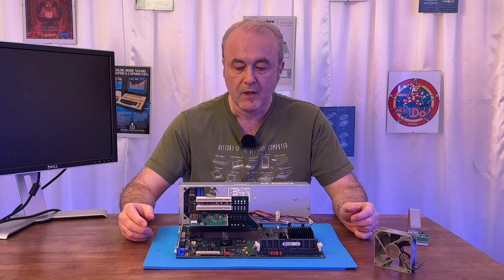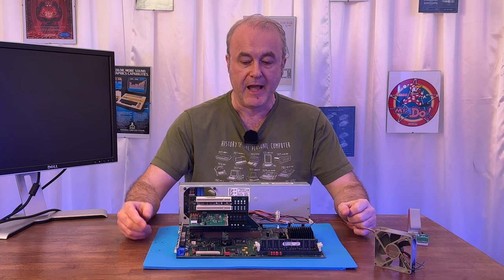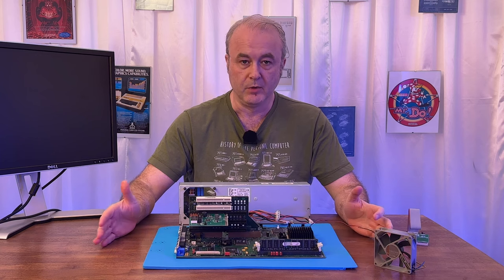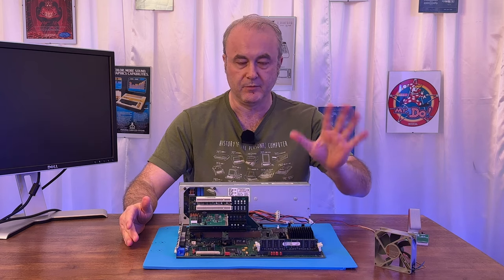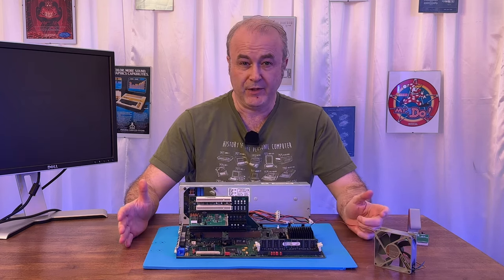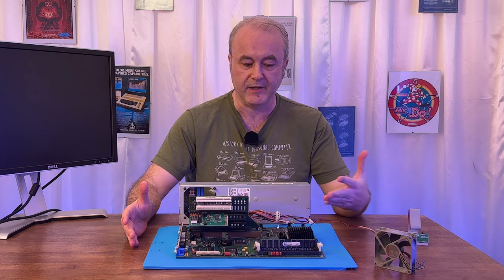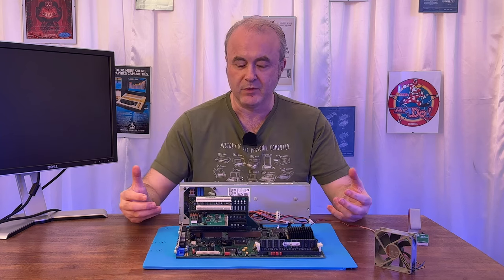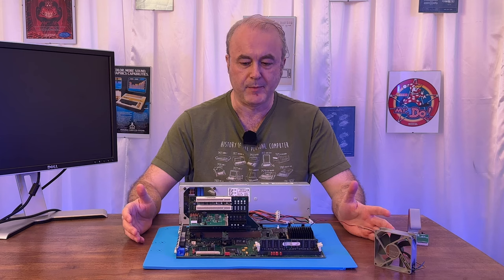At this point, there is obviously the scenario that I press the power button, it turns on, and I get basically dash, dash, dash, dash across the LED displays. And that would be horrible, because that would mean that there's a very low level error on this board, something wrong with the CPU, or maybe the RAM's balked. But as we discussed earlier in this video, I don't really think that's going to be the case, because we take the RAM out and we get beeps. That indicates that the CPU is running. We plug the RAM in, it does something, but then it goes quiet. There's nothing on the screen. But it's pretty likely that something is happening, although it's a bit weird that it doesn't make any beeping noises. Normally we'd kind of expect that.